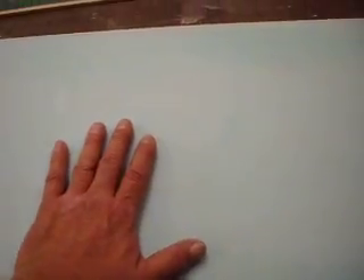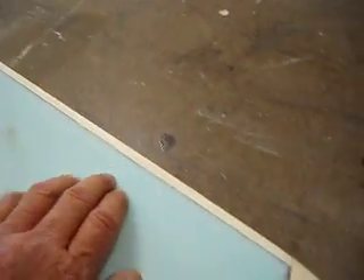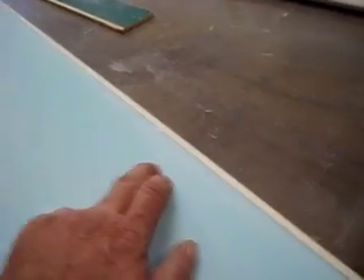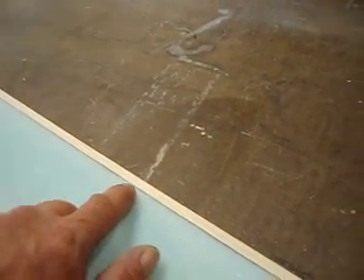There's the bottom — nice flat bottom airfoil. These are just plugs; these are not going to go on my airplane. We are not using these foam wings. I'm going to mold these, and what we're going to use is just the skins off of these — the top and the bottom skin. I'm going to get my slats molded in. I'm going to put a parting plane right where my slat piece is and mold the inner part of the shelf separately.